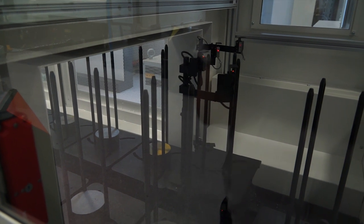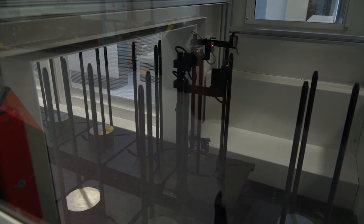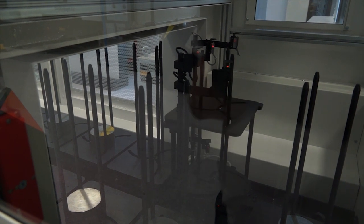What about the loading and the unloading process? We've utilised a rotary conveyor and an articulated robot. The rotary conveyor can provide 16 stations and the articulated robot can unload and load workpieces, which gives us unmanned running, can cover unsociable shift times, and aids productivity and also extra profitability.